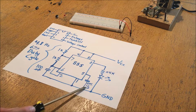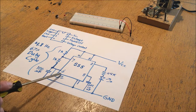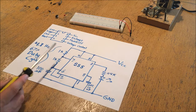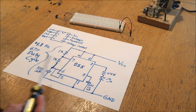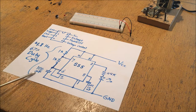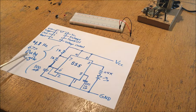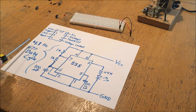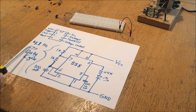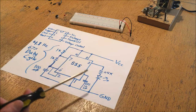We have the optional 10 nF capacitor to ground and our timing controls. The whole point of this circuit is to time a certain amount of time and have it cycle on and off over and over again. For this particular application with these values of resistor and capacitor I've chosen roughly a 4.8 Hz signal with 67% duty cycle. This means it flips on and off 4.8 times every second and stays on for 67% of the time - staying off for about 33% of the time - making a nice blinking light.